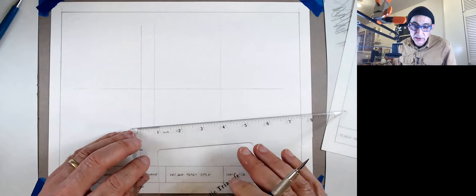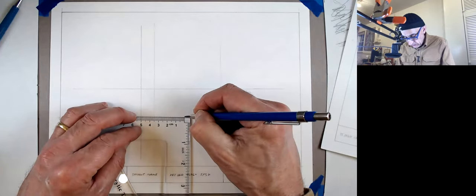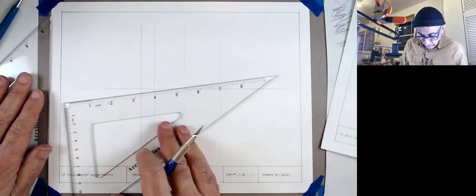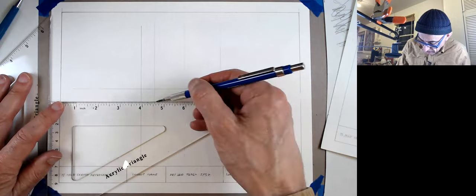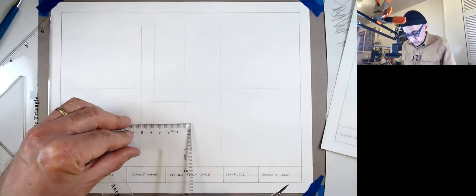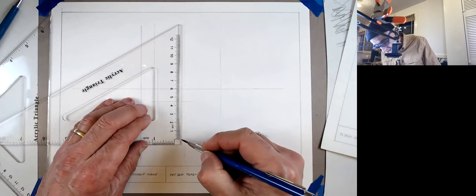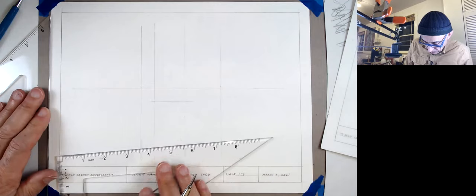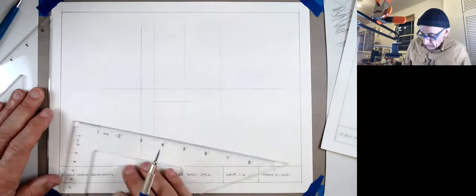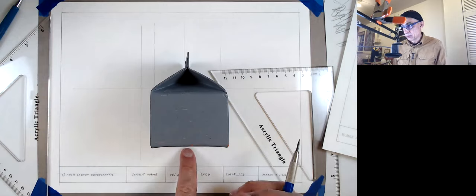The base is 35 millimeters wide and 44.5 millimeters tall — the height. Now I've got my first box. I need these two dimensions: D and D, which were 9.5 millimeters each from the top. Even a simple thing like this requires a little bit of planning and organization. Now that I'm done with my base, I'm going to darken it.